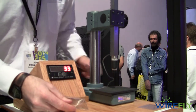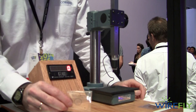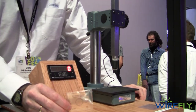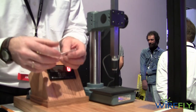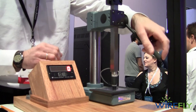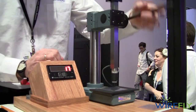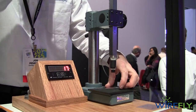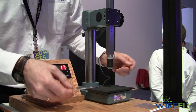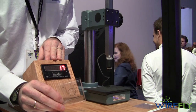Now we do the same test with the same scratch but going thinner with an alternative aluminum silicate glass at 0.8 millimeters. This one breaks at 17 pounds. It's not a surprise that as we go thinner the load-bearing capacity of any material tends to get weaker, so it would be lower than the thicker soda-lime sample — but that's quite low for retained strength, as you can see from the fracture.